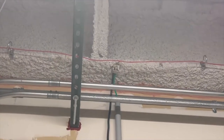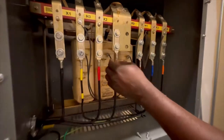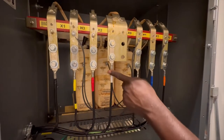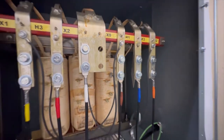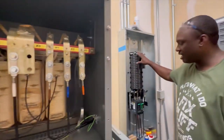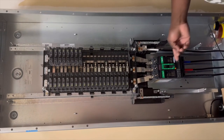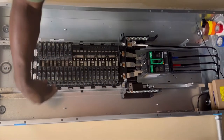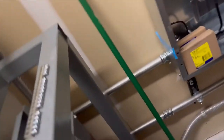You may be wondering how we get the connections like this — we use crimps and crimp lugs. That's it. And we torque it — we figure out the proper torque spec. This is ready to fire up right now, but we're going to pull some wire and stab some breakers inside the panel first. Check out that pipe work — we're going to make it work.